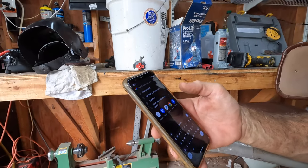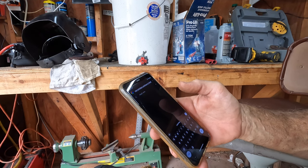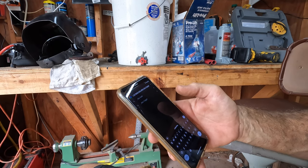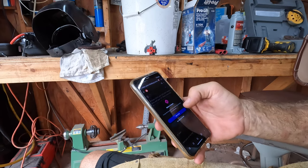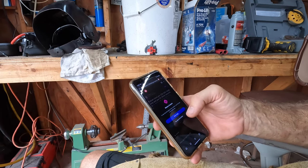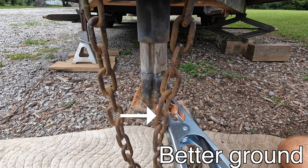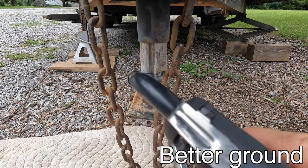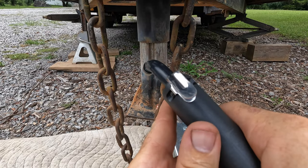Why does the Vulcan Omni Pro continue to feed wire after the trigger is released? Here we go. Reddit. Oh, come on. Mature content? That's annoying. So I finally figured out if the machine cannot detect a ground, it'll stop the machine but still continue to spool for 3 seconds.